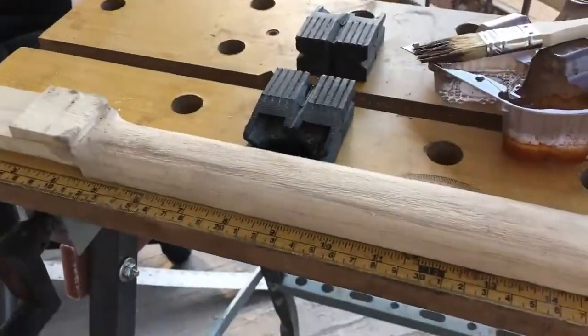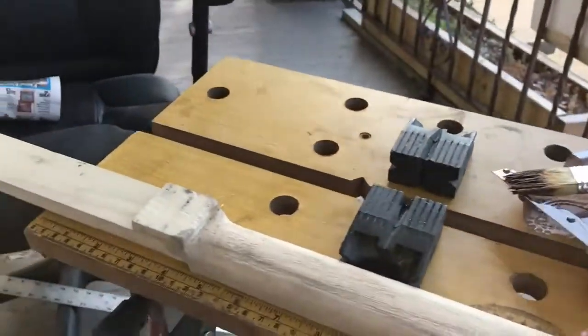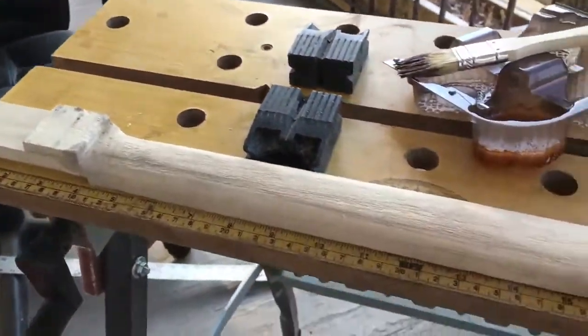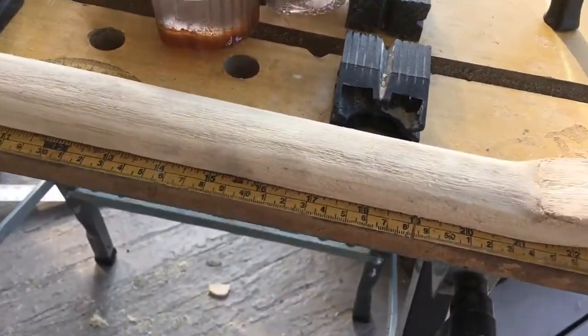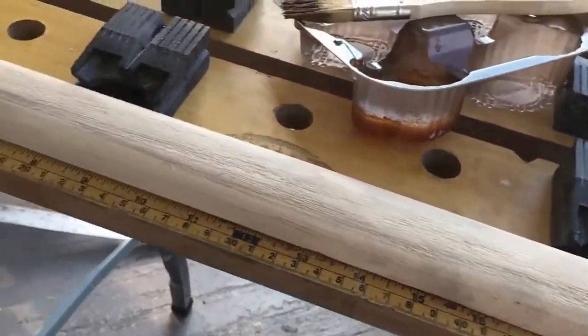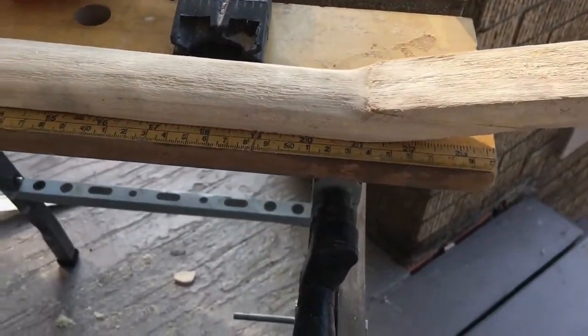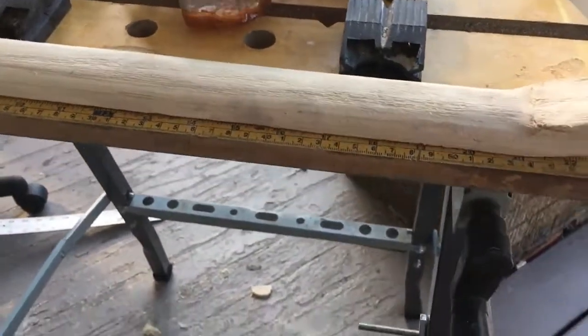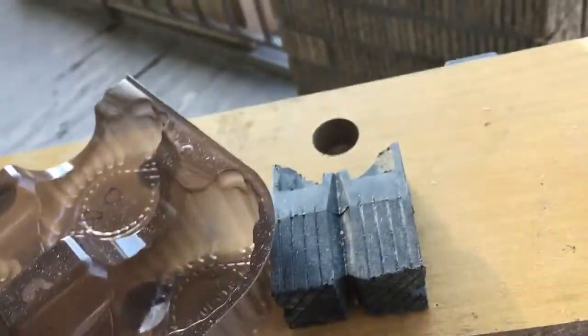So it's been, I don't know, a half hour or 45 minutes. It's almost 90 here in the Detroit area, so the tannin layer is kind of already dried. So I'm going to do the next part. This is a part that it's not immediately apparent. It actually takes a while for the staining effect to occur. So this is 4 parts water to 1 part of the vinegar solution, the vinegar rust solution.